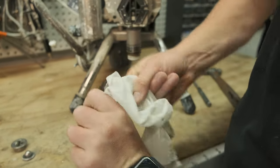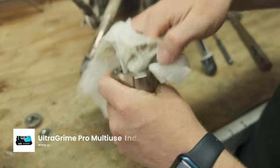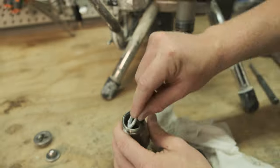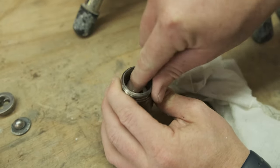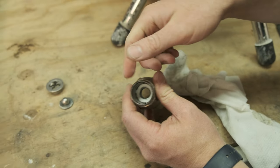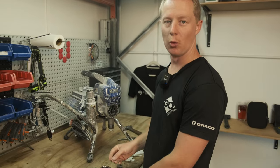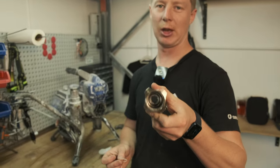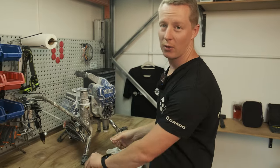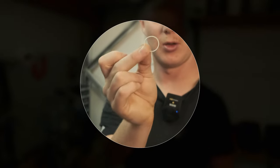Give the inside a bit of a wipe, get around the thread a little bit — just use a rag. I'm using Ultra Grimes; you can find them on our website. This washer is just a bare basic hose washer that sits in there to create a seal between the bottom of the lower housing and the top of the suction tube. Just a warning: at the bottom of the inside of the lower housing is a tiny thin little o-ring. Be careful that it doesn't come out when you knock the ball and seat out — without that, you cannot hold pressure.